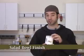The second method, which is actually my preferred method, is to coat the board with a wiping varnish. You can buy varnish specifically for food items under the name Salad Bowl Finish. My favorite is made by General Finishes and it's available at rockler.com — I'll post a link to that in the write-up.